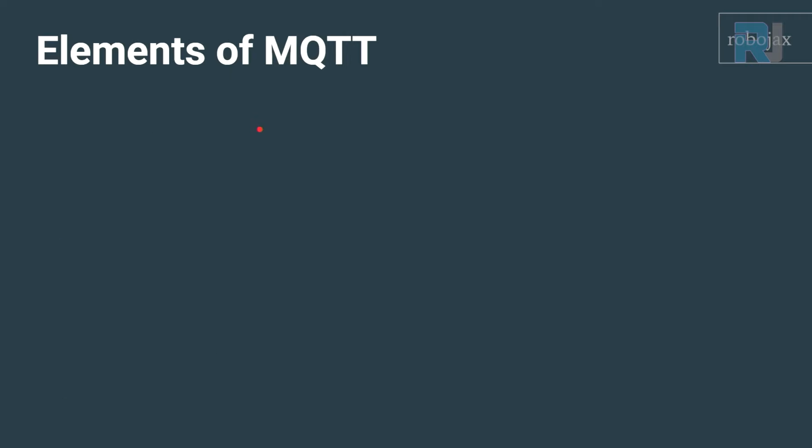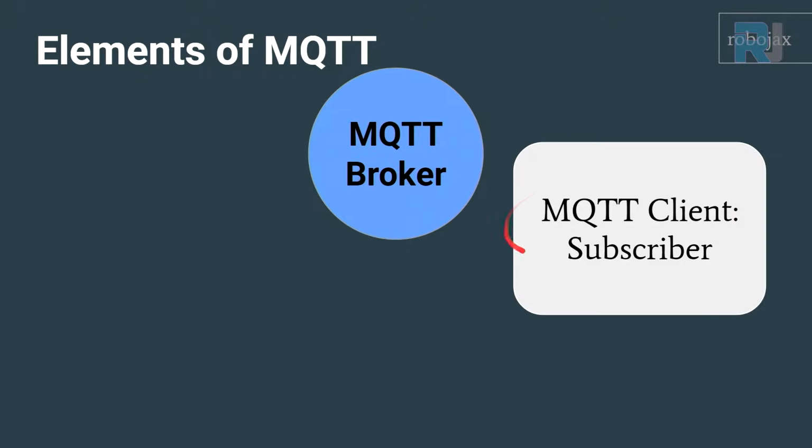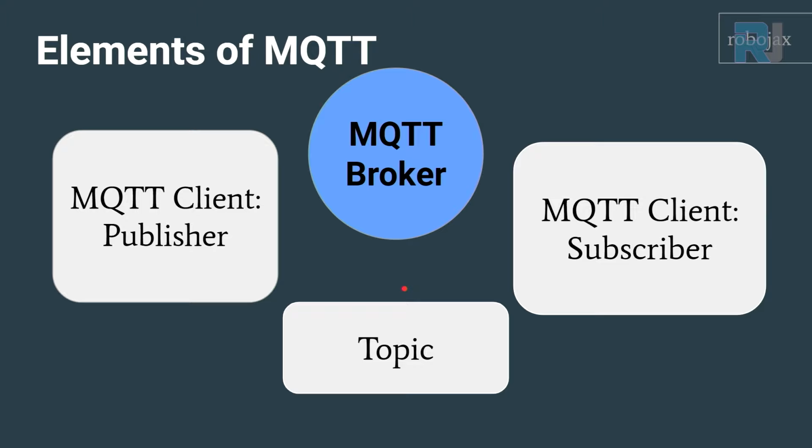So first we have to understand the elements of MQTT. We always need to have a broker, and we have an MQTT subscriber and an MQTT publisher. The most important thing in the broker is the topic for which the messaging is being published or subscribed.